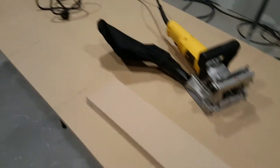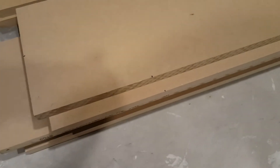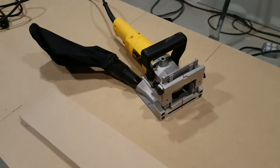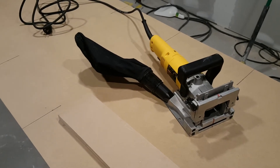I'm going to put glue along here and along here. This is going to be the back of the enclosure, and I'll have eight-inch sides that come up. I need to cut out a bunch of little holes for these biscuits all the way around — you can see I've marked them. I started right at the middle of this piece and then I want a foot out all the way around. Here I did two, six inches from center, and the same thing on the other piece. That's where I'm going to put the biscuits, and that should line up nicely.